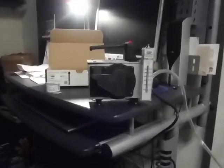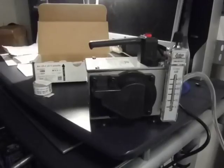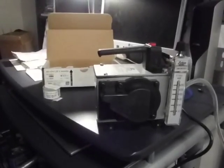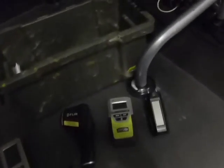As I was saying, you need to determine if there's excess moisture or water loss within the house. The thermal hygrometer is a great device for saying what the relative humidity is in a certain area. Other devices that are necessary to determine whether or not there is a moisture problem would be something like a moisture meter.